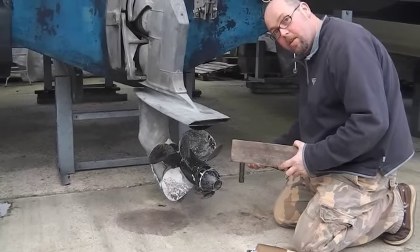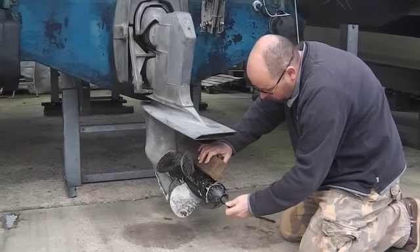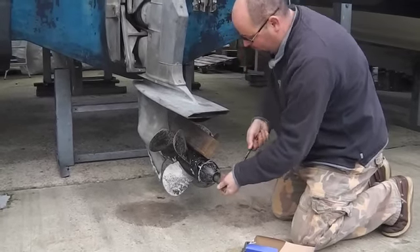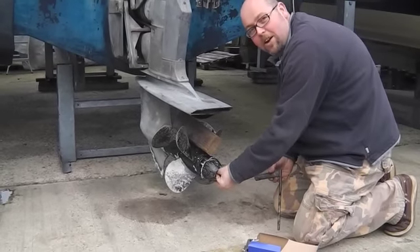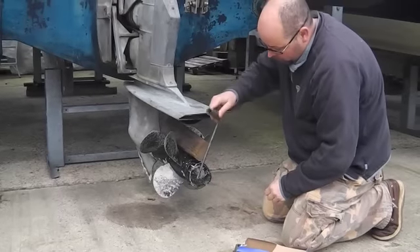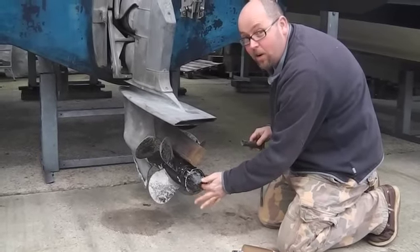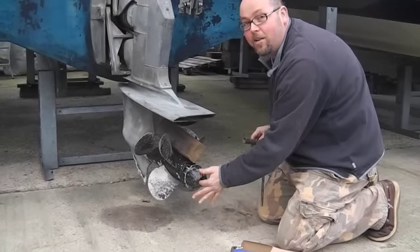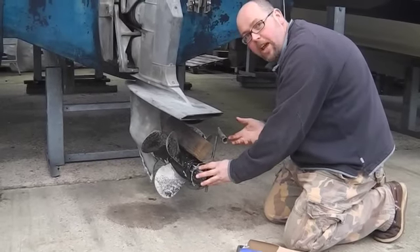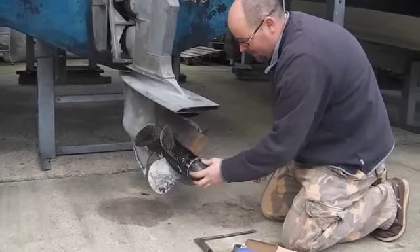To stop the prop spinning, I can either put the boat in gear in reverse, or in this particular case I'm just going to jam a bit of wood in between the two props and undo the locking nut. It should just be just tight, not gorilla tight — just nipped up so it wouldn't come undone. So I undo that. Just correct me if I'm wrong — you've undone the nut which holds the cone on, the locking nut, to stop the cone falling off or coming undone on its own. And then the cone just undoes. It's just a right-hand thread — the old righty tighty lefty loosey rule. The cone unscrews.